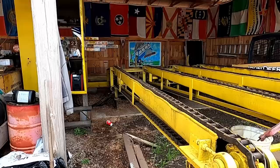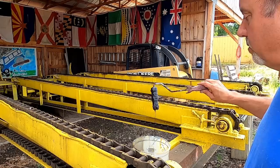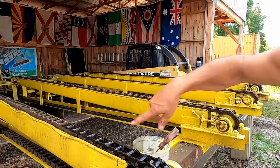About every three or four times a year I go ahead and oil up the chains on the log deck. All I do is fire up the bus motor — this is the used oil from the bus motor — and you just turn it on, let it run. I lock the pedal in the cab so it keeps spinning. It takes a long time because these are 16-foot long, so you're talking probably a better part of 40 feet of chain by the time it makes its loop around.